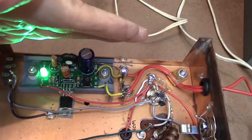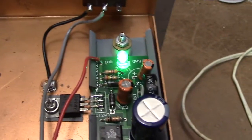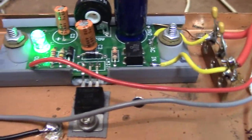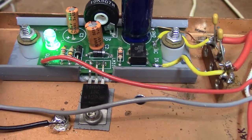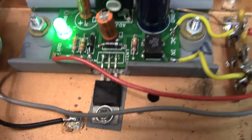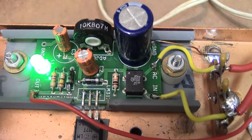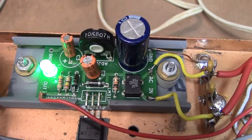With it on the back, you'll notice a green LED on the power supply indicating it's on. We've changed the wafer switches out to toggle switches — a very simple circuit. The power supply is mounted on a piece of one-inch Panduit track cover. The pass transistor is mounted to the chassis. These little power supply boards are from VA Kits — you can buy them off eBay assembled or as a kit.